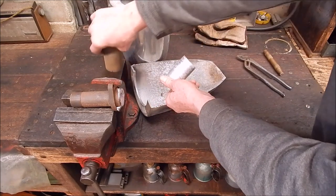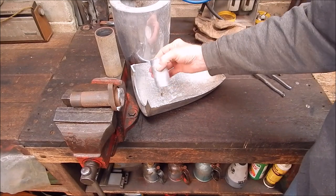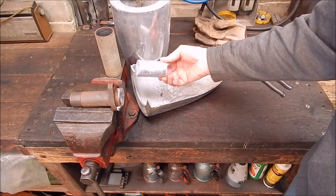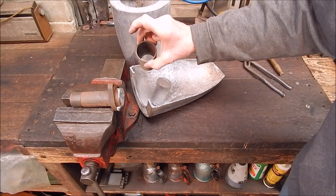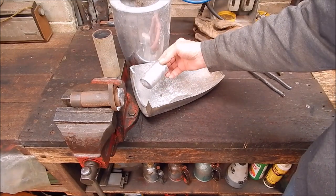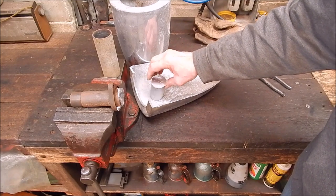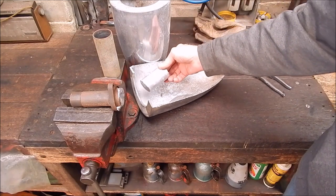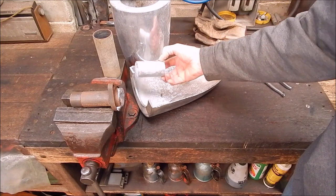This may be alright, and it could be total crap. Look how easily it comes out — it just fell out. You can see how easy it is to do this if you just pour it into a steel tube. It's got to be totally uniform, no seam, and then the aluminium will contract more than the steel and it will just fall out like that. Let it cool — don't quench it with water or you'll definitely get shrinkage. Preheat the mould first, as I've shown you. Pour it in as soon as it's melted, no later, then let it cool down on its own. Don't do anything else to it — it'll come out looking like that.